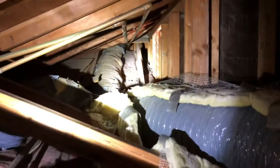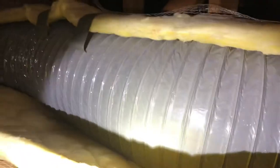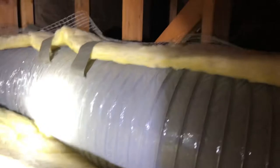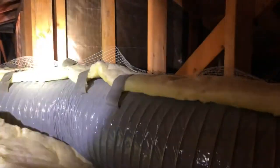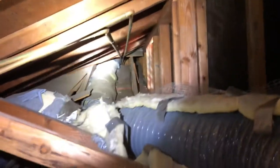You can see how bad it is. It's just an indication of how old it is — all the outer layers have dried up and are peeling off. It's only made out of plastic, and then you get the insulation wrap to keep it from leaking, and then the inner wrap. Once that inner gray part leaks, now you're blowing hot and cold air into the attic and sucking dirt from inside the attic into the house. All the way up there it's falling apart — this is a definite must-have fix.